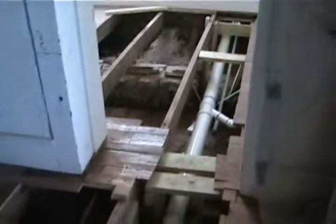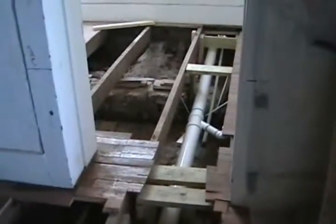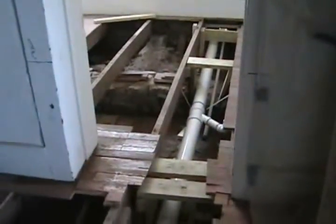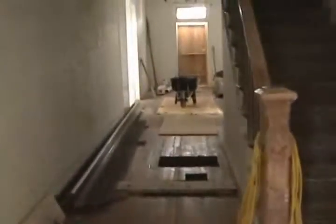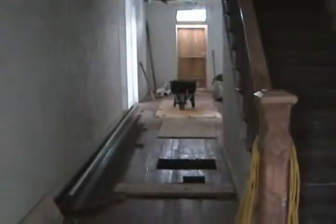Now, as I said, this board was to hold this pipe, so that right here on this little small section, we've got a little bit more than 1/8 per foot, which is the minimum requirement. We did that to give us a maximum amount of slope allowable going up to the north end or northwest bathrooms. I did stop them here. You can see all the pipe that's sitting in place and ready.